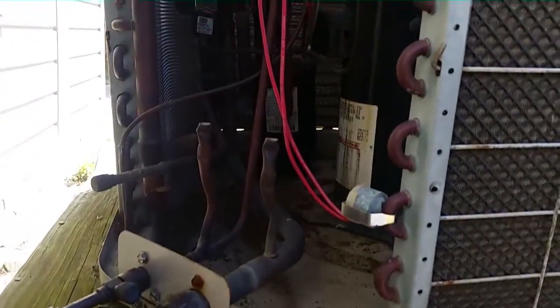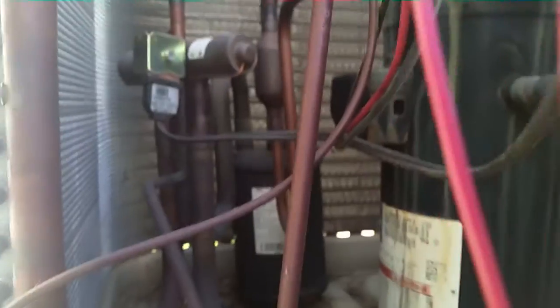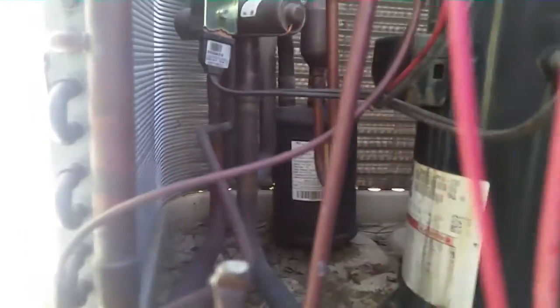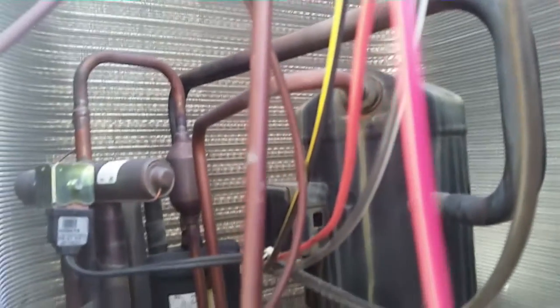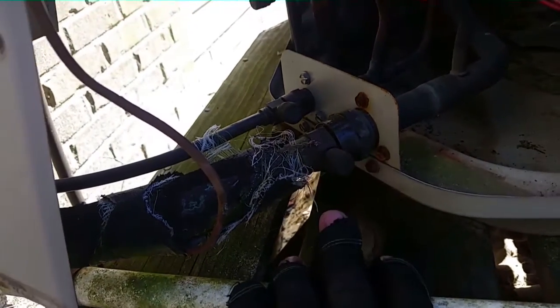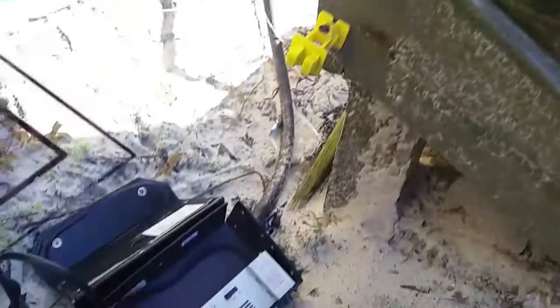I'm warming up the H10 outside. Our evaporator was leaking. I want to double-check some of the problem areas, meaning the accumulator inside here. They tend to rust out, and as you can see it's rusting at the bottom. The machine is 10 years old, but in Nordyne years I think that's like 13 years. I don't see any oil on the coil out here. It doesn't have service valves — it has these little fittings, and I don't really see them leaking very often, so that's a good thing. About to fire it up and we'll see.